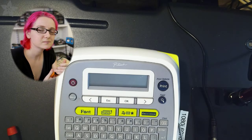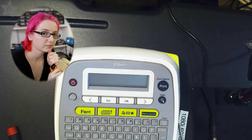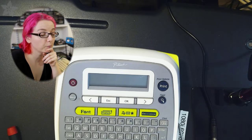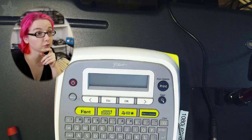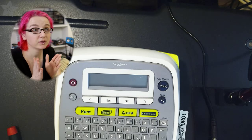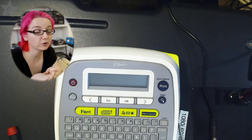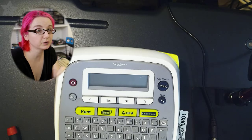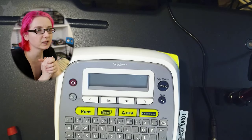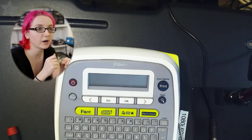So this is another question: if you don't have a fuse, and the fuse breaks, what do you do? Well, the bad idea that you should do to start is just short it with a piece of wire, and then plug it in. But you plug it in with your benchtop power supply, so you can measure how much current's going in, because it could be that the fuse blew for, especially with glass fuses, just mechanical reasons. It got smacked, and the little wire breaks.